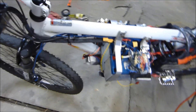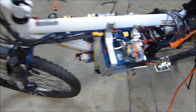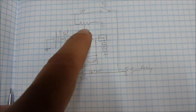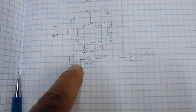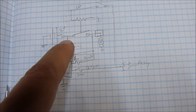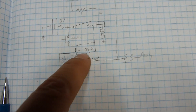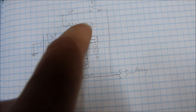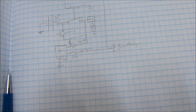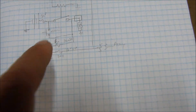So in order to start this up — I've got the kill switch but it's not going to turn it on; the Arduino's not lighting up. I'll show you why with a little schematic here. You can see the main 100-amp contactor, and that's going to feed the DC-DC converter, which in turn feeds the contactor back. But we need a momentary switch in here to bypass and charge this up so that the loop continues. When I cut it off, it'll drain whatever stored energy it has, and then you can't turn it back on without using that momentary switch to get it fired up. So this is a little quick fix to get that going.